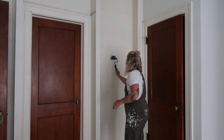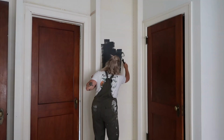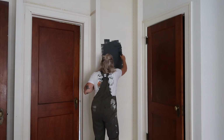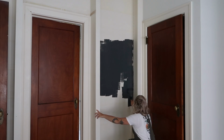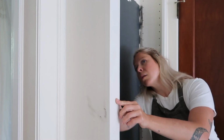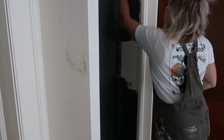Unfortunately, a lot of the trim and cabinetry in my house has been previously painted with oil paint, and these built-ins are no exception. So I am actually using a product from Benjamin Moore. It is a direct to metal paint. I had them mix it in a Farrow and Ball color called Railings, and I don't have to prime, I don't have to sand. I'm able to just paint directly over the previously painted oil paint here on these built-ins. Most people are not going to have this issue, but I still will link everything below in the description box just so you know what I'm using.